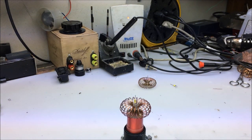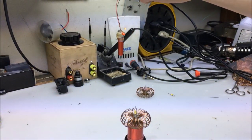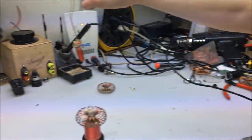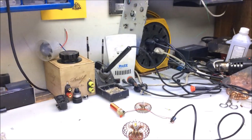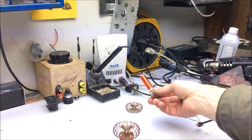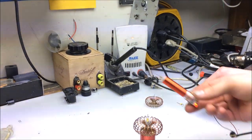What if I told you that it is interference from a Tesla coil? Then I would ask you to show me how. Well, you're in luck. Here's what I found out: I made this little Slayer Exciter Tesla coil, and for whatever reason, the frequency that it makes actually ends up jamming the feedback of my soldering iron. I've got a little switch here that I've been turning on and off under the desk — and that's why we've been having problems. He totally got me. Unreal. That's a decent little Slayer too. Flip it on for a second — fairly effective range. I like how it mimicked the wire as the wire was going over it and acting like a wire issue.